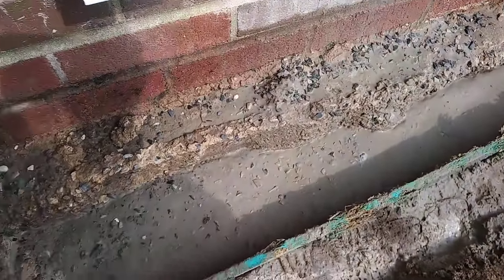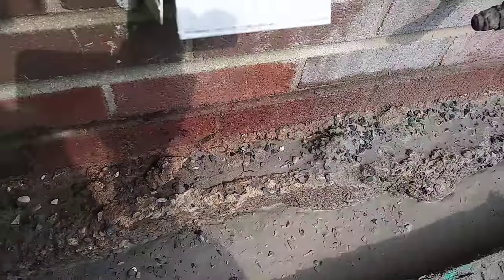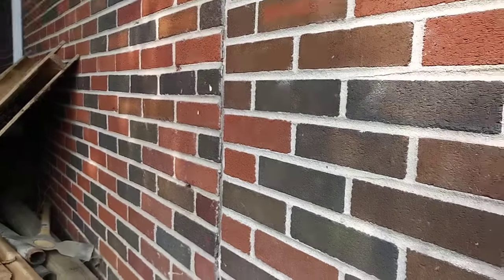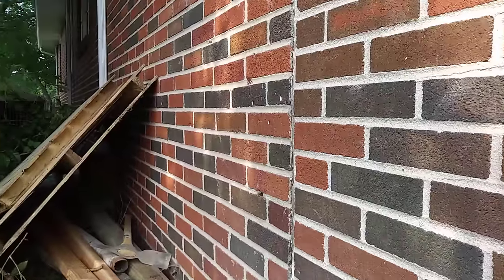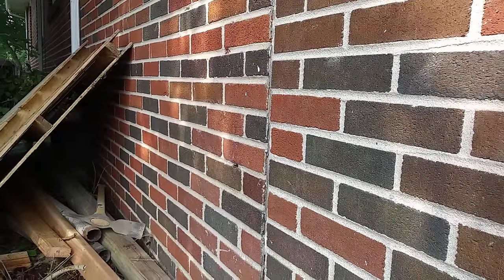This is one we just poured today. You can see the shelving is the old footing — just 12 inches deep — and they built their brick right on it. You can see the shift; that's how you know there's settlement. This is probably 50 years old and it's already shifted more than an inch. Someone went in there and repaired the brick, which is really in vain.